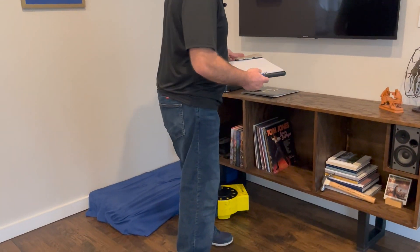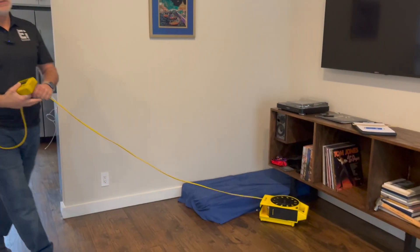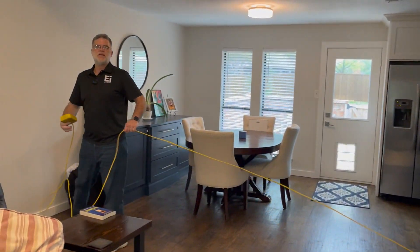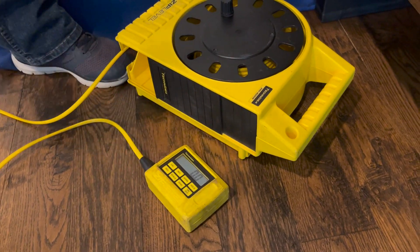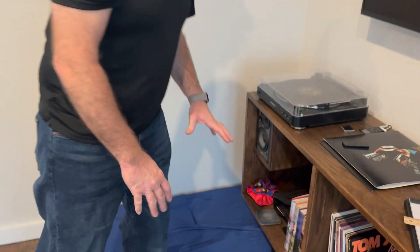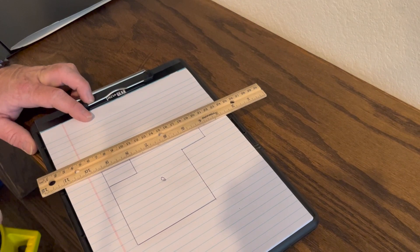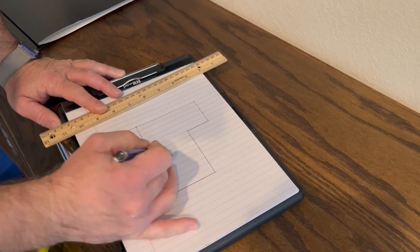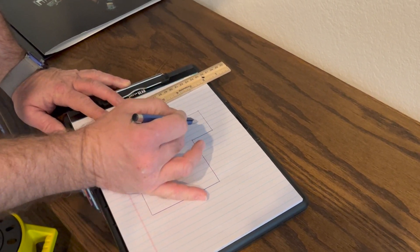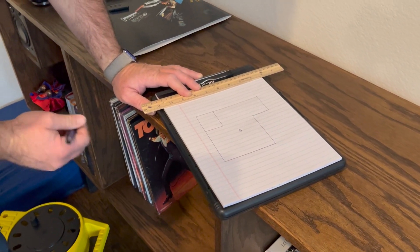Let's start the process. There's about 60 to 70 feet of cord in here, so there's always enough cord to get this done. It's going to zero out right here. On our graph, this will be the center — we'll put a zero there. That's the center of the house. What we're going to do is walk the perimeter of the house with the remote, and that'll tell us which way the house is settling and if there's any foundation issues — specifically if there are cracks outside or inside the house. This will give us more of an idea of how much the house has settled.